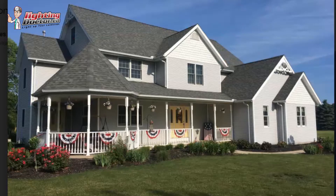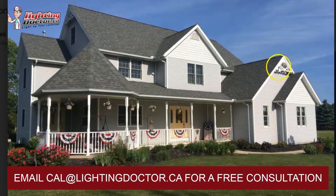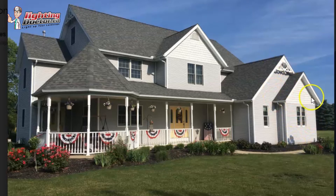Around the front of the house, I would position one of those up lights right underneath the window, shining more upright. A good rule of thumb with accent lights is to always shine them more upright than at the house — that way you get more subtleties in the siding. I'd have one here and one on each side of the window, and then along the walkway, stagger some path and garden lights in between the up lights.